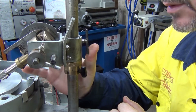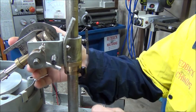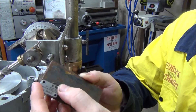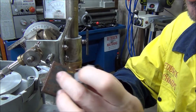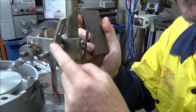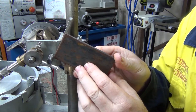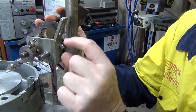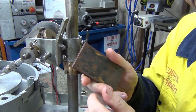Welcome back everyone, this is part two of the faceting machine - installing the switch. What I'm going to do first is make a little mount for this switch to go on. We'll cut that out of a piece of steel so we can drill and tap it, giving us something to screw it to. On this bracket here we'll weld it on, and the switch should screw on. We can also elongate the holes where it bolts on to give a bit of adjustment to make the switch trigger at the right spot. I'll head over to the saw and cut this to the right shape.